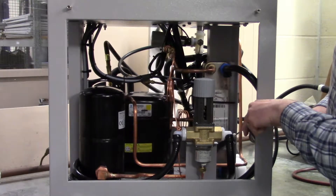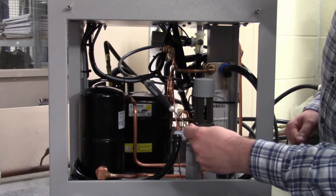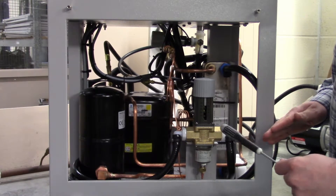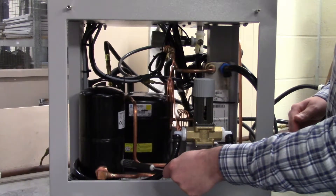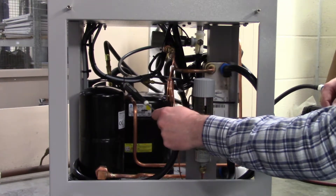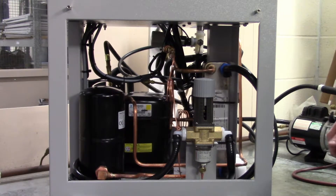Leaving the condenser brazed plate heat exchanger, the liquid refrigerant travels into a liquid receiver, whereas in an air-cooled unit the liquid refrigerant would be stored in the bottom rows of a thin tube condenser. In this one, we need to increase the volume in the circuit by using a liquid receiver. After leaving the liquid receiver, the fridge system becomes much the same as in an air-cooled chiller — we go through a filter dryer, through a solenoid valve, and into an expansion valve. After the pressure and temperature has been dropped, we feed liquid refrigerant into the evaporator heat exchanger, where cooling can take place.